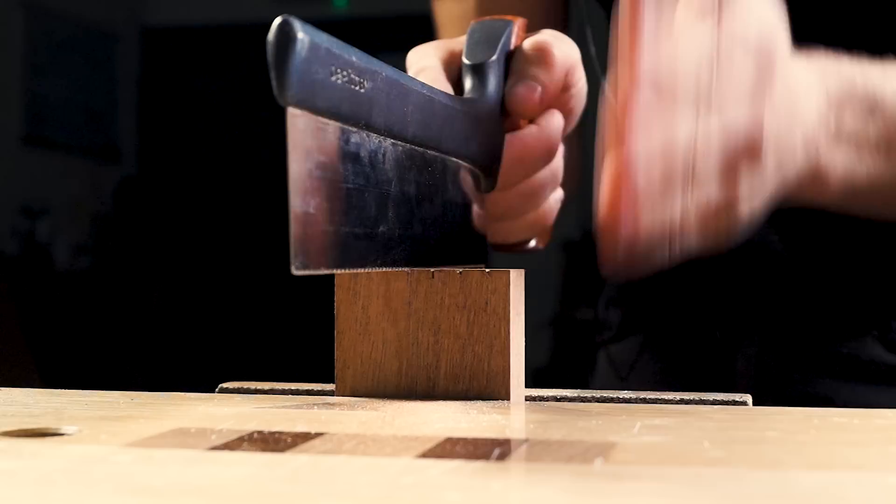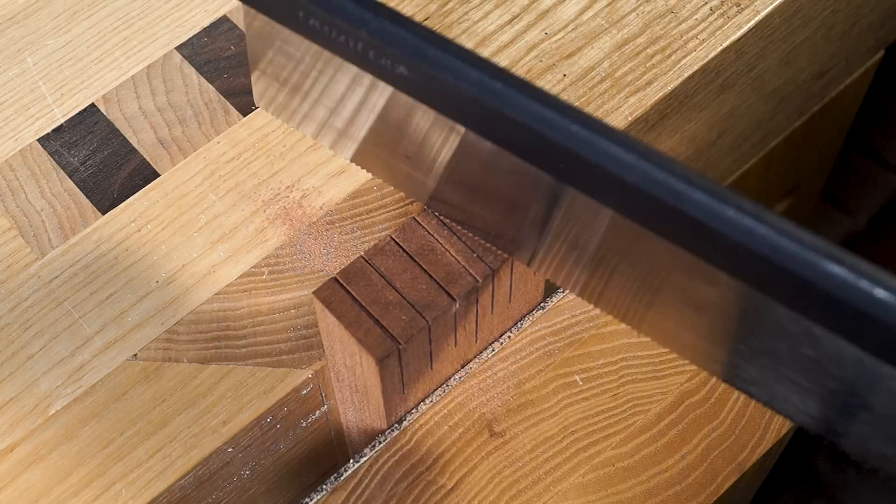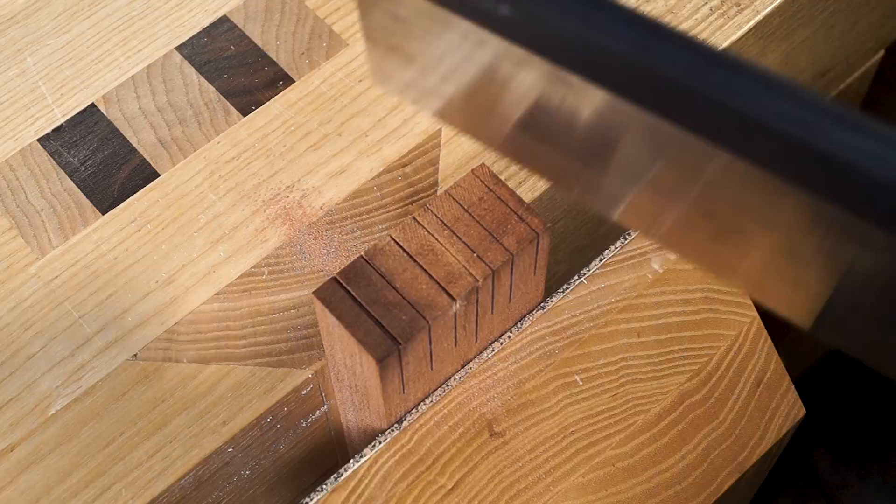Keeping your thumb there gives you a good point of reference. Another technique: put the saw plate down the timber and line it up with one of those lines. See the reflection in the saw plate - it kind of just looks like the timber carries on right through it. However, if you slightly angle it, you can see that it's bent the timber. That is a good indication that you're not cutting square, even if you don't have any lines to work to.